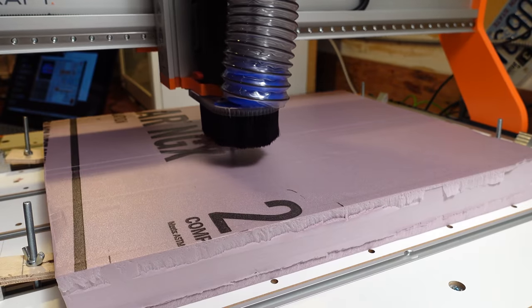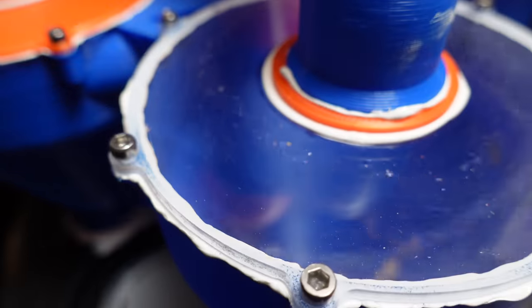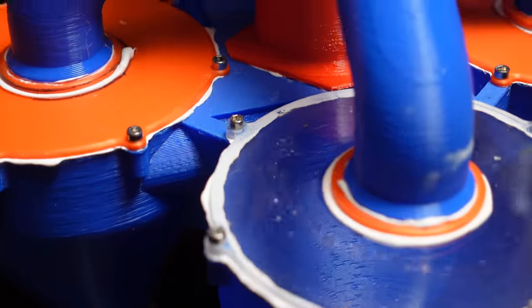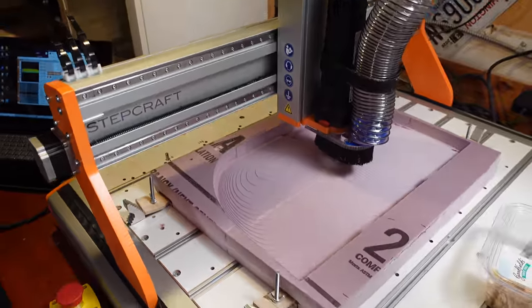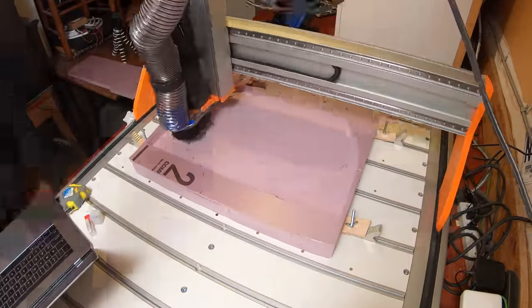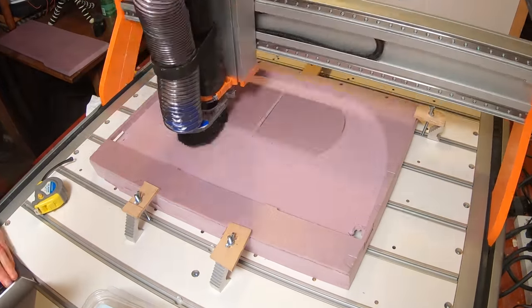Here's machining the main wings out of 50mm thick XPS insulation foam. I was using the four parallel cyclones that you might recognize from my 3D printed cyclone video. Machining these wings takes a while, and it's a lot of work to set up the stock and the toolpaths, but ultimately it allows you to make shapes that would be impossible to cut with a hot wire. All in all, I'm pretty stoked on how these have turned out, and I'm really excited to use this technique for more planes in the future.